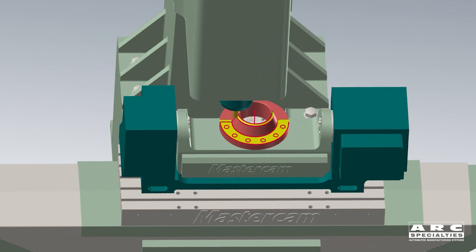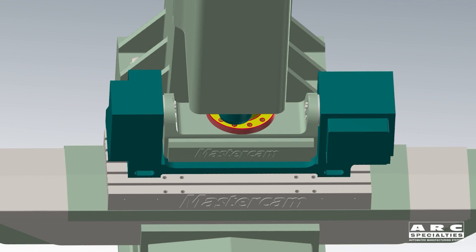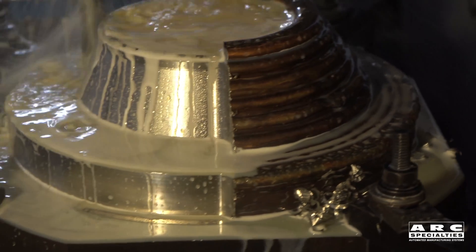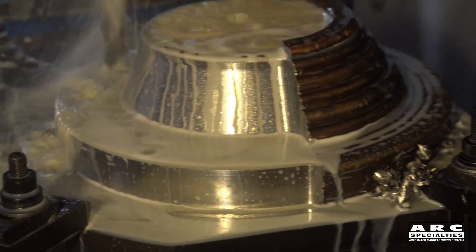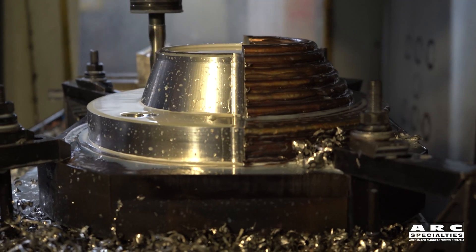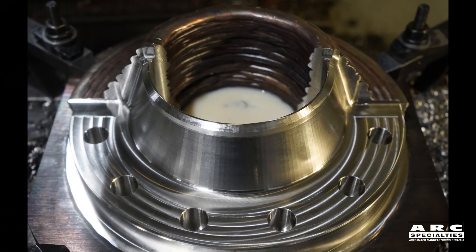What we did was decide to build a flange using all weld metal. First thing we did was weld it, and then we decided we'd machine it. Normally you would do this on a lathe — of course we did it on a mill, just so we could do half of it. We wanted to be able to see and show that we welded this part. So here's on our five-axis CNC mill — we're drilling, tapping, turning this part, and finishing it up.